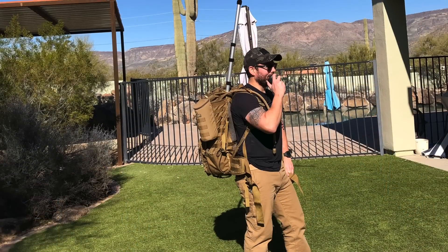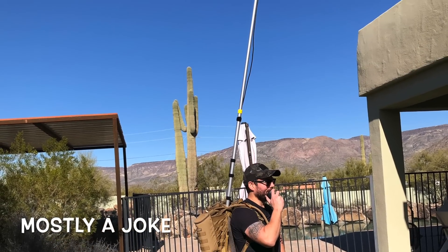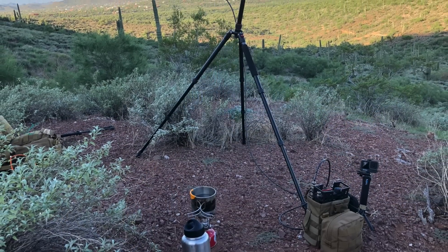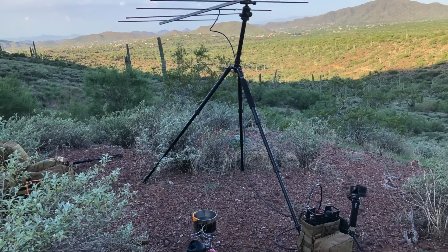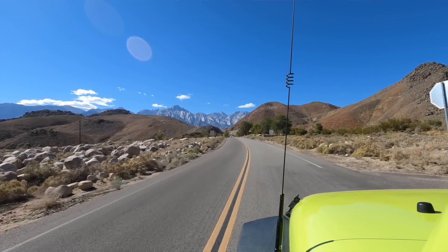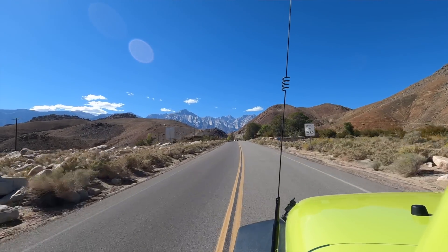The other antenna I've used in the field is a directional antenna like a Yagi. I'll mount that on something like my camera tripod and I have no problem running higher power — in fact, I can get by with lower power because it is directional, so I typically run it at about 25 watts, though there's no reason I can't do 50 as long as the Yagi is rated for that. For the vehicle, it's simple — whatever antenna I have mag-mounted, hood-mounted, or mounted on the vehicle at that time works beautifully, and I'll run 50 watts.